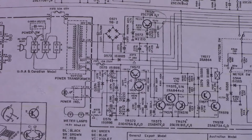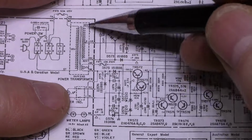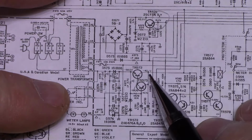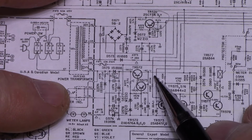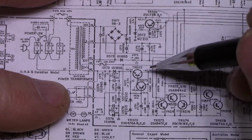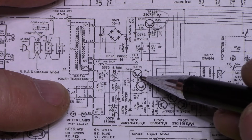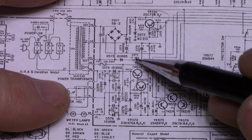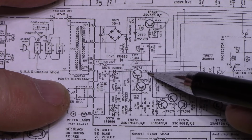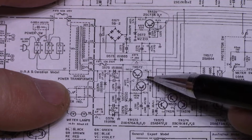Let's see here. Let's pull this down a bit. There we go. And right here is 19.4 volts. And then we also have this line here, negative 66.5, and then it runs through this transistor and comes out at negative 42 volts. There's another source that we can consider. This transistor here is a TO-220, and it has very high current capability, more than enough for our LEDs. So I might just go from here, negative 42 volts, to ground, and that would be our source.